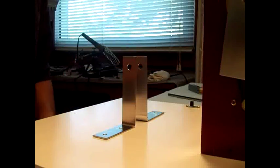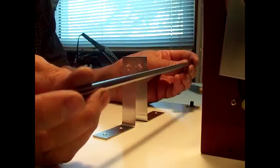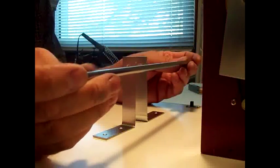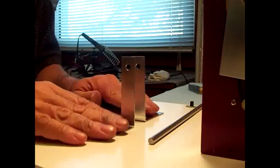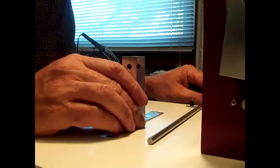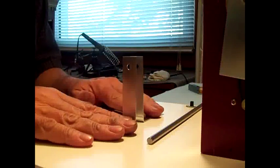I also had a piece of quarter inch rod and cut it to about 11 inches or so, then took sandpaper and polishing cloths and polished it up. Did the same with the brackets — drilled two screw holes in the brackets to mount to the base, drilled a quarter inch hole on the other end to hold the shaft, then bent the brackets in the vise. I glued a couple pieces of wood together to make a right angle and laid them in the vise so it wouldn't scar up the polished aluminum, and bent them at a right angle just by hand.